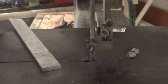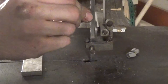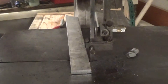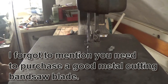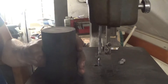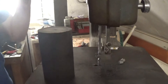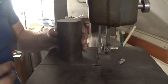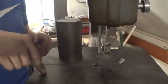The one drawback is it's kind of cobbled together, so if you're doing really thick stuff you have to go really slow or the blade jams. You just have to back out and let it run. But it does work. I just finished cutting this two and five eighths inch piece of cast iron stock — no problem. I think I was done in maybe 10 to 15 minutes.